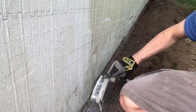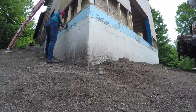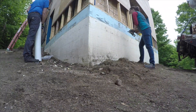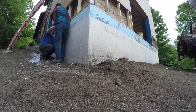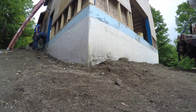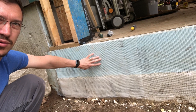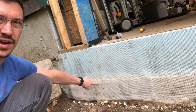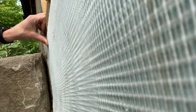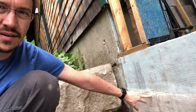After you've prepped your styrofoam, you install what's called Sticky Mesh HD, which is a fiberglass-reinforced mat with an adhesive backing that sticks right to the styrofoam, and you trowel right over that. It gives the tough coating a bit of strength and a consistent way to bond. I've patched my two-inch rigid styrofoam here, I have the ICFs down here, I've put on this sticky mesh over the whole thing, and now I'm going to trowel on my first coat.